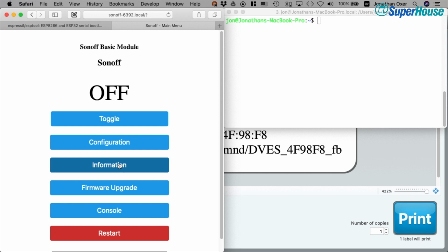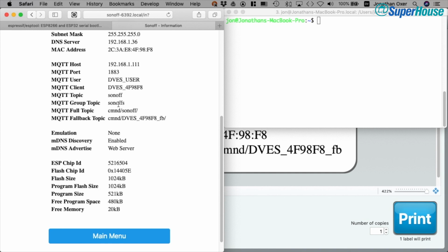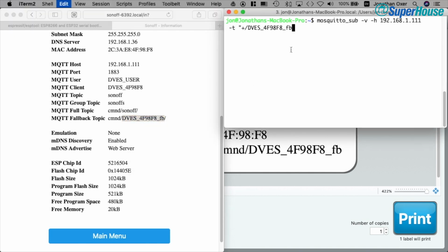And what we'll do is go down here into information, because what I want to do is look at the MQTT settings. We can see in here, for example, the fallback topic. We'll need that in just a moment. So on my local machine, I'm going to subscribe to the appropriate topics on the MQTT broker. And my host is that, and I'm going to subscribe to a topic that might look a little bit strange to start with. I'm going to start it with a plus, then I'm going to copy this part of the configuration, paste that in, put a slash, and then a plus on the end.